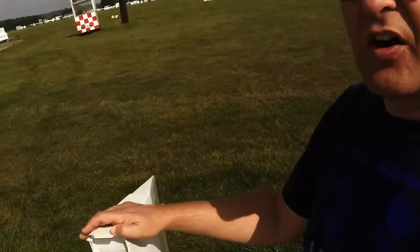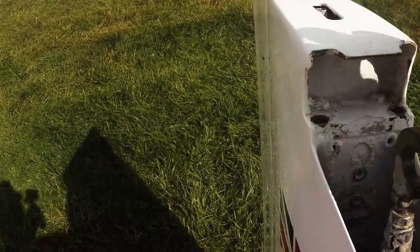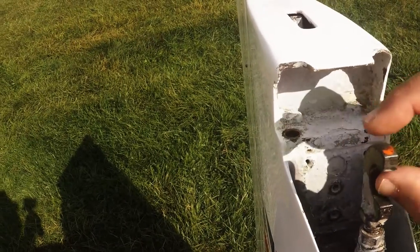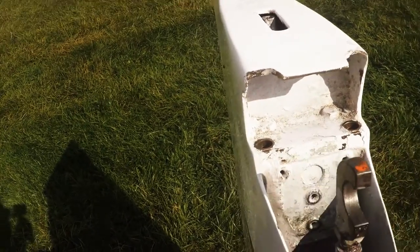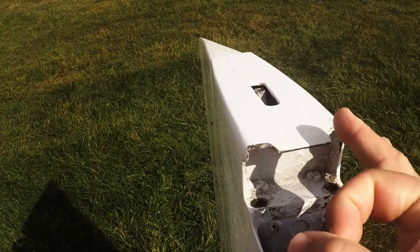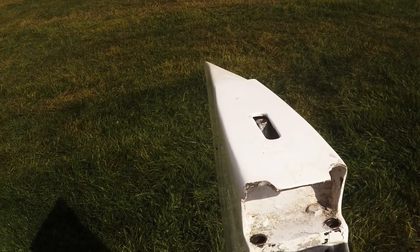Using the camera, what we've got is basically this hook. The tailplane comes over and there are basically two rollers. One slots in and one slots above, so it's got to slot in between the two at an angle and then go in and hook around here properly. When we've got the tailplane, there's a Perspex little window — about the size of a one euro coin — that you can peer through.